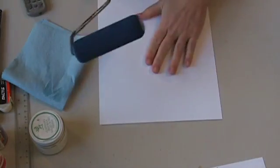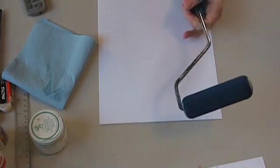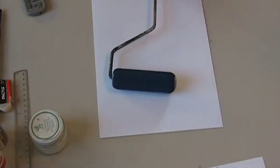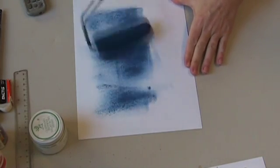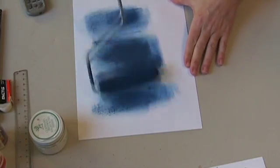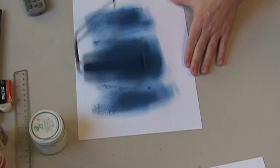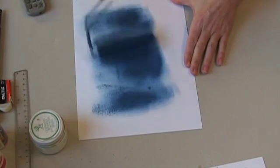It's wonderful. The difference between a surface that's smooth when you roll it and one that is not is going to be in how long you roll. That sounds totally goofy, but it totally works. You roll until your roller starts singing at you, which means you just keep rolling the wet paint over and over again. And you'll hear it. There's kind of like a little music to it. It'll be a different sound when it's juicy.